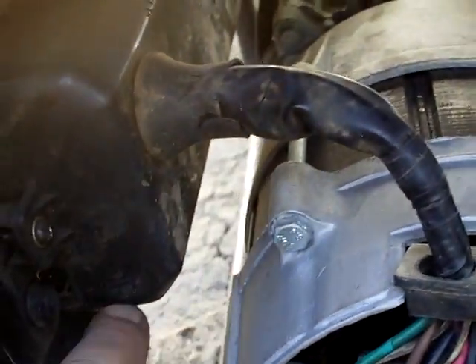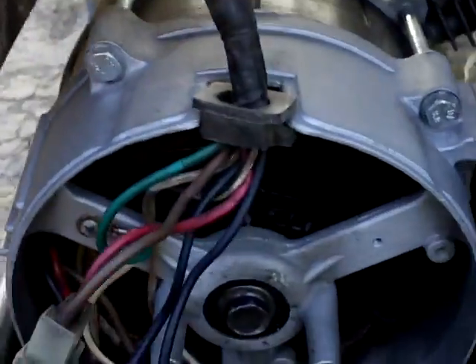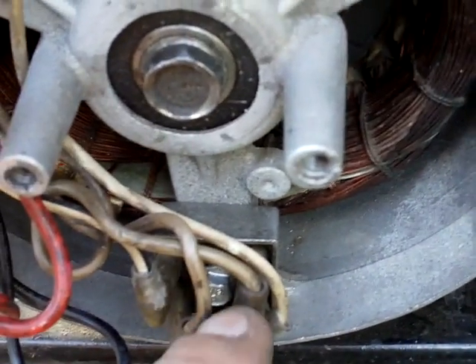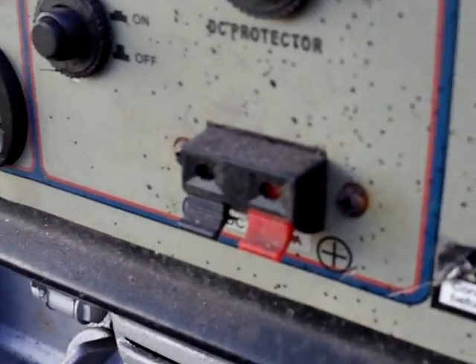These two black wires are your capacitor wires. The capacitor goes up through the grommet into the housing, so if you want to change your capacitor, you have to pull your panel — that's a big deal when you go into the dark and want to get your generator running. The only other thing in here is a bridge rectifier with four wires, and that runs the 12-volt for charging batteries.